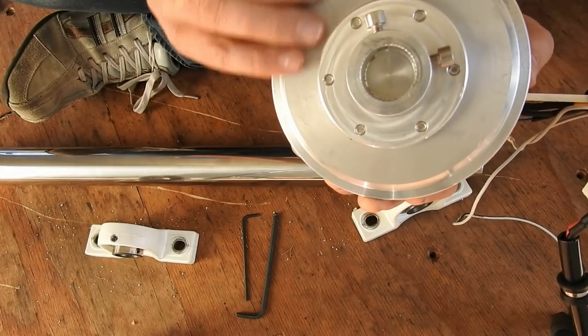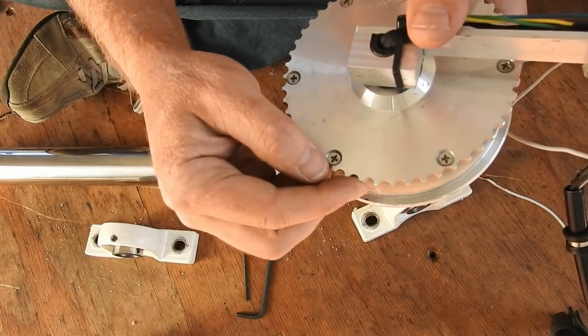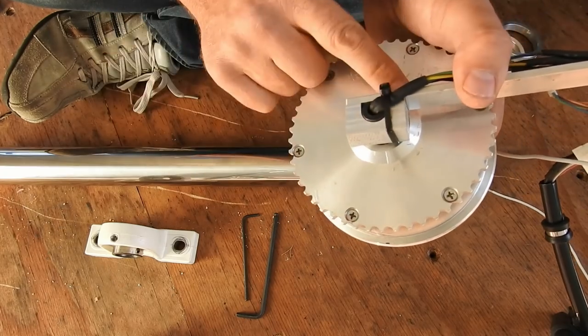Here's my wheel motor — I've machined that shaft straight and put a clamp on here. I've machined the back of this like a sprocket, in case I decide to put a secondary lock in — there'll be a little pin that can just drop into it. And I've put a torque arm on here.